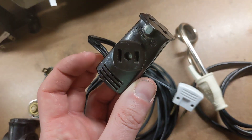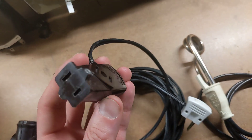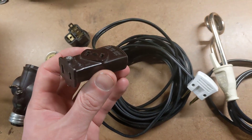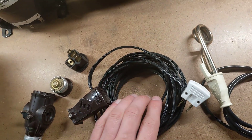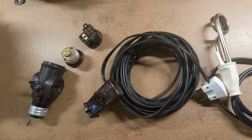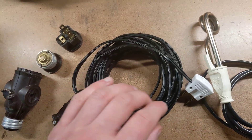Normal extension cords have polarized plugs, but on the female end this has a three-way tap-style plug using insulation displacement — all vintage components, though you can buy everything new. You can make your cord 50 feet, 100 feet, however long you want, just paying attention to how much current you can pull through an 18-gauge cord at the length you choose.